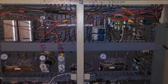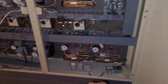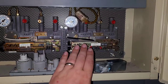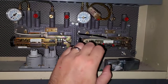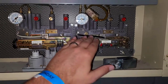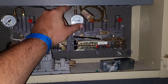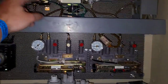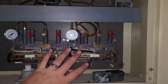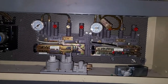Looking at our main pneumatic relay panel here, it controls multiple air handlers. This one down here is our problem child — it's controlling the chillwater flow valve, the actuator valve. You've got main air coming in, your sensing tube, and then the output going to the actuator, running through this EP controlling when it gets to work. Everything appears to be correlating properly here and I am getting the output that I'm seeing at the valve.